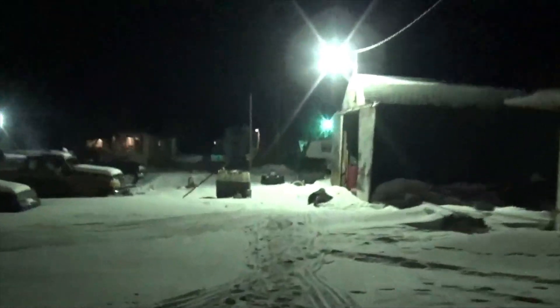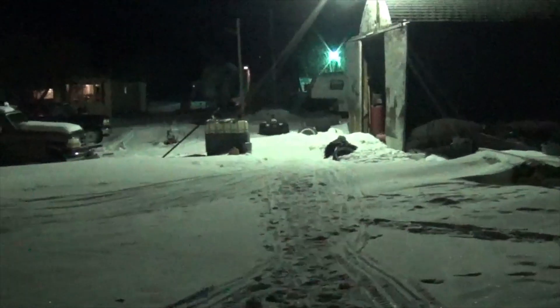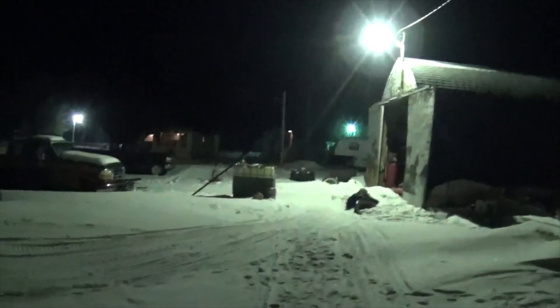I worked hard on the rest of the video so I'm going to include it anyways — back to about an hour and a half ago. The old shotgun yard light over here, which is a 400 watt mercury vapor fixture, does the exact same thing, although I've never looked at the arc tube with the camera like we did with that other light. I can see that same dancing effect on the ground. And before I repaired this yard light, I had a clear 400 watt mercury vapor in the shop yard light all of last winter, and I didn't notice any weird light dancing on the ground then — I'm about 98% sure.